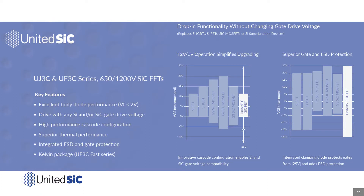United Silicon Carbide FETs, offered at 650 and 1200 volt classes, offer a number of attractive features to designers. These switches employ a high performance cascode configuration with optimized silicon carbide JFETs and low voltage silicon MOSFETs. They have an integral body diode with excellent performance: a low knee voltage, a low forward drop, and low recovery charge. Superior thermal performance allows substantial current ratings in conventional packages. They have integrated ESD gate protection and can be operated efficiently and safely across a range of typical silicon and silicon carbide gate drive voltages, working well as a drop-in replacement with standard silicon 0 to 12 volt designs or with established silicon carbide MOSFET gate drive voltage ranges of 15, 18, or even 20 volts.